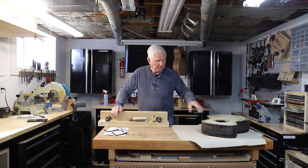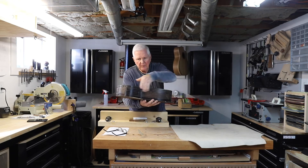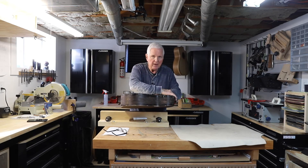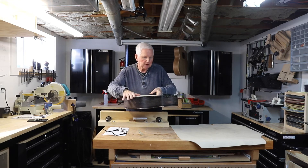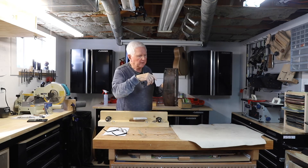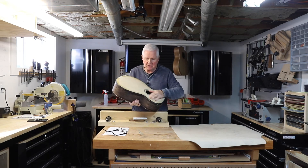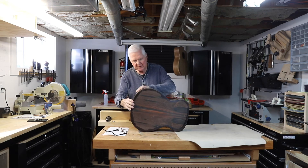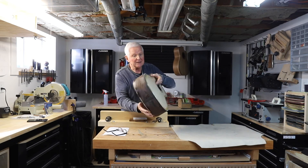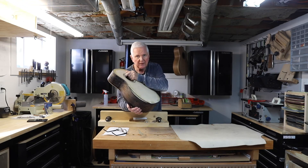Let me give you an update as to where we ended up today. As you saw we started off with the tape — you had the side view of the tape around the guitar on this particular side. We then went to this side of the guitar, taped this on, and flooded all of this with CA or super glue all around here and along here so it would go down into the guitar area and hold the binding nice and tight, as well as around the purfling. I still need to do some scraping and smooth this out, but we'll get to that in the next video. I've already started the armrest and you'll see me carve that down to perfection in the next video.